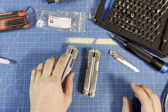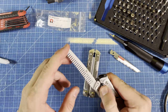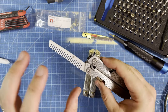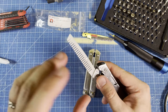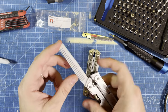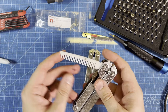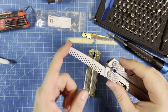They're not available on Shapeways because the Nylon 11 material is not available directly on shapeways.com — they're only available through third-party websites. If you're asking about whether this can be made in steel, I did try to get it made in 17-7 stainless steel, which is a magnetic steel, but they claimed that the tongs or fingers on here would not work out due to the way their process of polishing and sintering works. So they kind of rejected making something this small out of stainless steel.